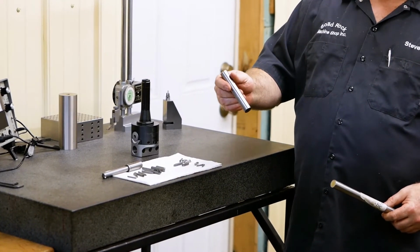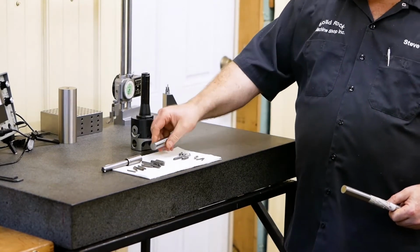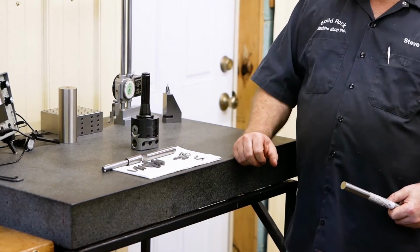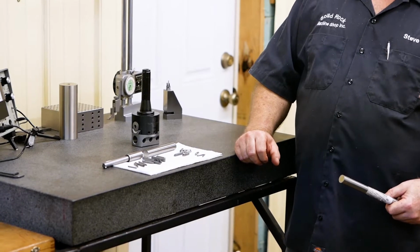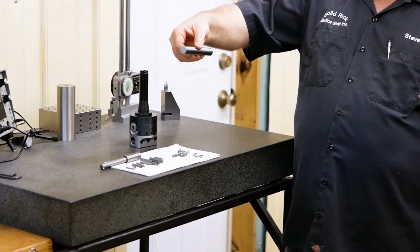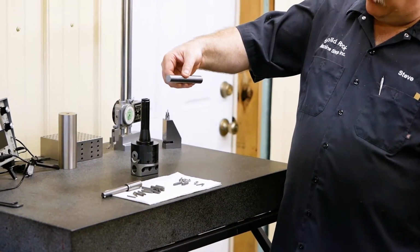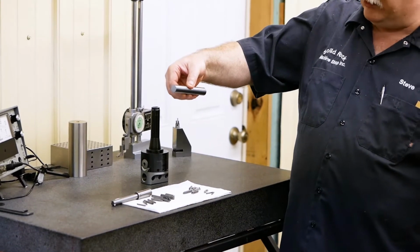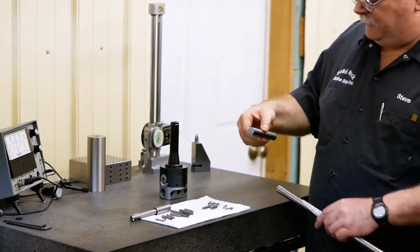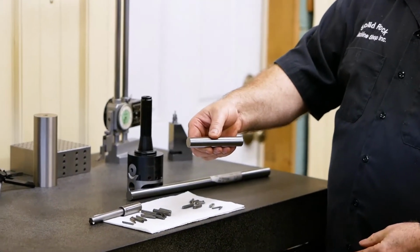It's because you're taking a hot piece of steel, when you quench it and you bring the cooling down that rapidly, it's just going to put a lot of stress. One of the things that you'll find a lot of stress in, if you do your own heat treating by hand, and you'll see this, a lot of times people will heat treat something like this and dunk it and quench it and all this stuff. They'll drop it in the oil like this. That is the worst way you can do that.